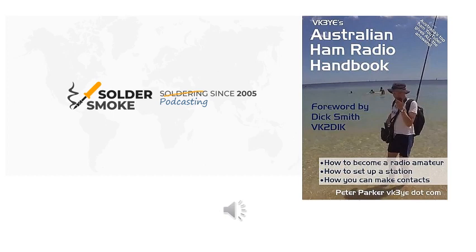I can understand the view that a good receiver is extremely important. It's probably become easier than before to build a reasonably good receiver, and especially with direct conversion — although you still have the issue of the audio image. It's become a lot easier even to build simple SSB receivers. A crystal filter and five or six transistors will deliver quite respectable performance.